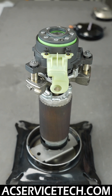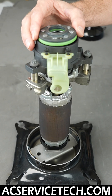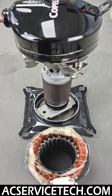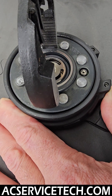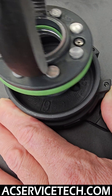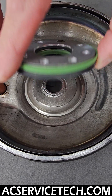That equalization is only between the discharge of the scroll plate and the muffler assembly — not across the whole compressor. So the next time the compressor is electrically turned on, it's unloaded because this floating seal has shifted downwards. It waits until high pressure coming out of this tiny pinhole from the scroll set pushes the floating seal upwards to seal off the discharge assembly against the muffler plate.